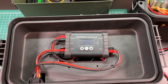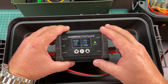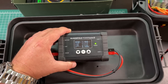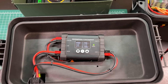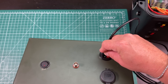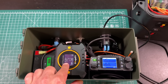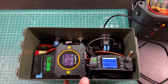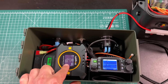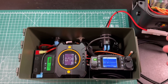Let's try pulse width modulation first, then we'll go to MPPT. First, the BuddyPole Power Mini 2 - it's a great PWM charge controller. We'll start with the BioEno 6-amp charger, plugging it into the yellow and black solar input. We'll flip the switch and we can see we're getting 14.4-ish volts in - this battery is pretty much charged, but now we're getting an amp and a half of current. Now, what happens if we put 13.8 volts into it? We're only seeing 13.6 volts and 0.17 amps - so it can't charge above what you're putting out, and it's not going to fully top the battery. So it is working, but not by much.